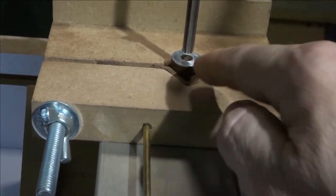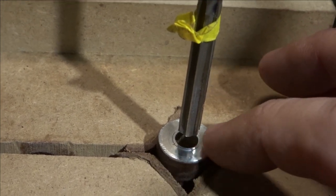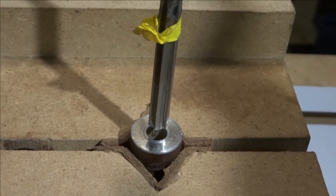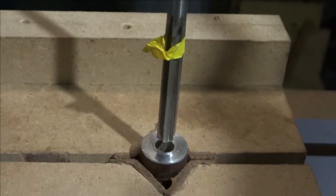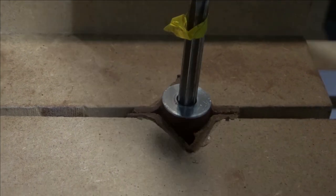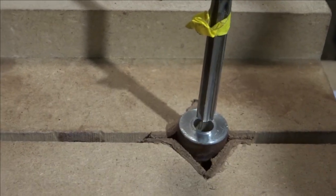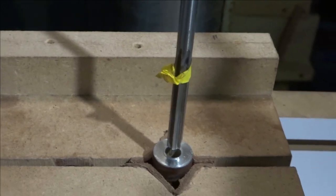So the stummel is in there. Hopefully you can see that this is just the face of the shank here, that we've taken that old tenon off of. And what I've got chucked up here is just a 6mm chucking reamer, and that's simply there to allow me to say, okay, this is lined up properly, so that goes down into that hole without any issue. So that was just used for alignment. Now everything is clamped down and solid, and I can switch over to my drill bits.